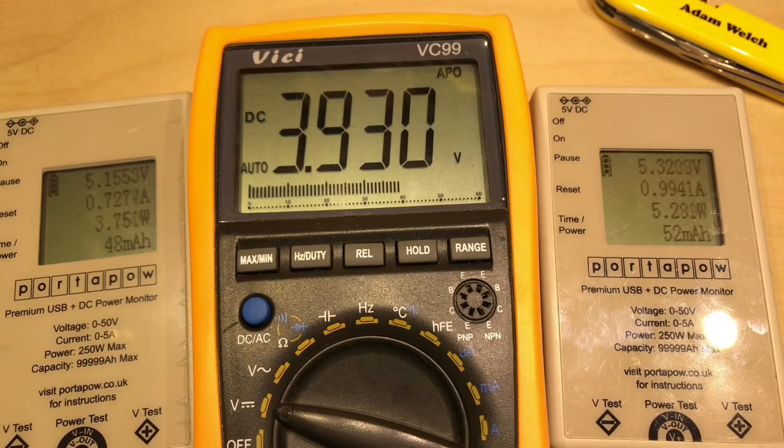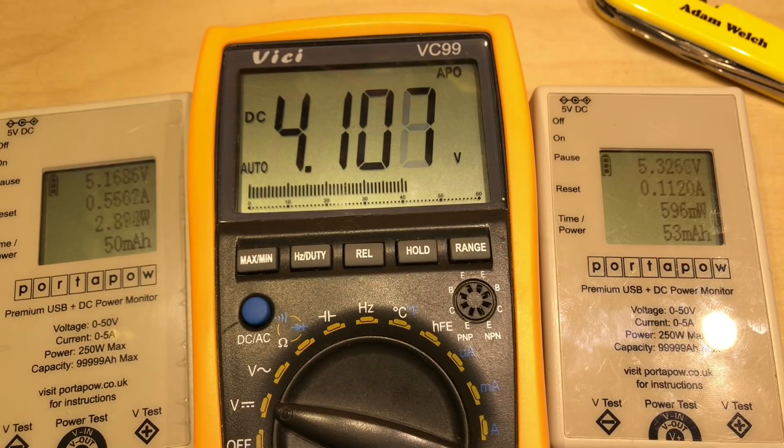So let me turn down that USB load again now and take it to something much more reasonable — back down to 100 milliamps. The voltage of the battery increases again because there's less load on it, and of course now with 500 milliamps on the input and only 100 milliamps on the output, there's a spare 400 milliamps or thereabouts left over to actually charge the lithium cell. So if you do use this module, you may find that your lithium cell is in an almost constant recharge state, which might not be optimal.